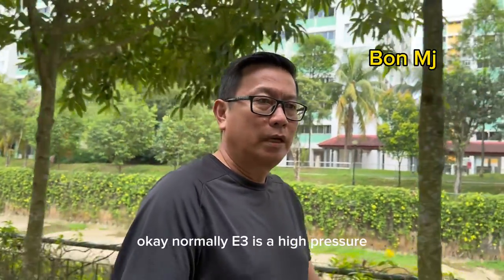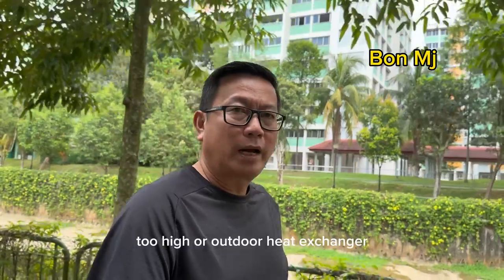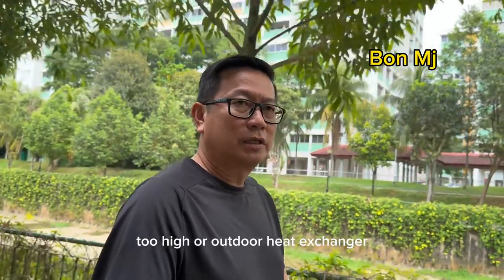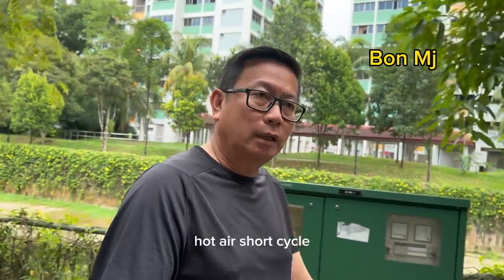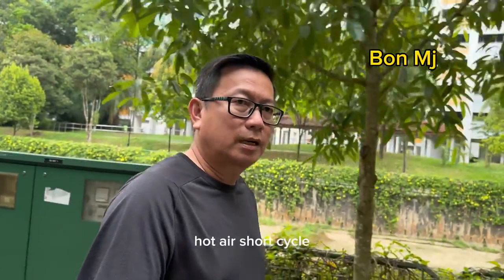Normally E3 is high pressure, too high, or the outdoor heat exchanger coil is choked, or maybe on the outdoor condensing unit, the hot air short cycles.